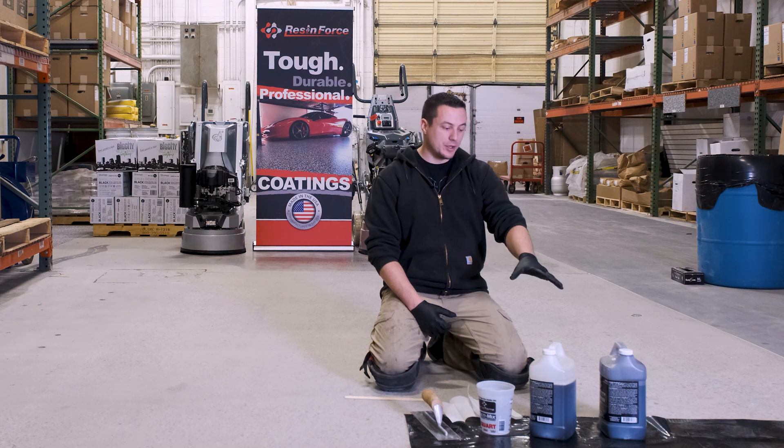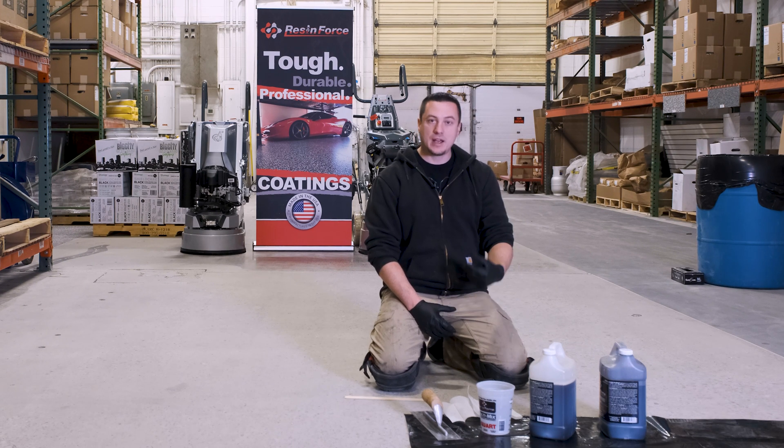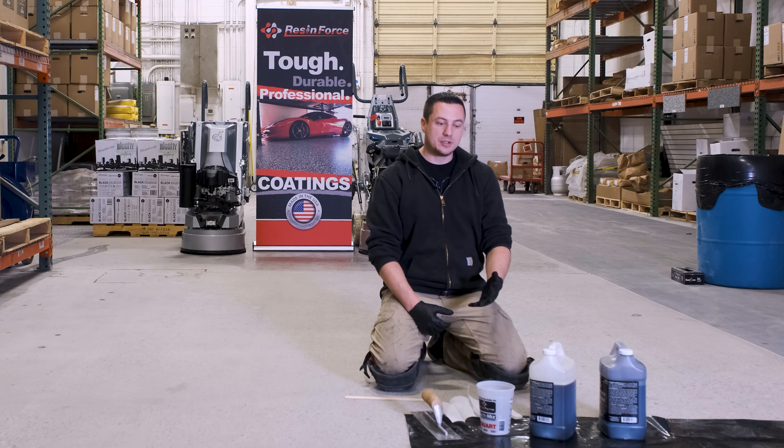Getting started with what we're going to do today, we're going to use a polyurea. If you're doing it for concrete polishing, you're typically going to want to do the grout coat after your metals — so after you cut with maybe your 30, 50, 70 grit metals — before you switch over to your transitional resins. If you're going to put a transitional 50 copper or transitional 50 ceramic, you're going to put your grout coat on the concrete before doing that transitional 50 grit, maybe 100 grit, but 50 is typically where I like to do it.